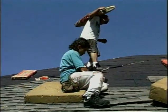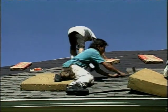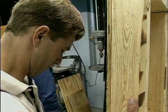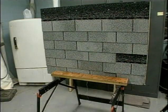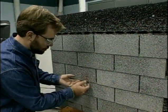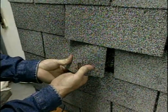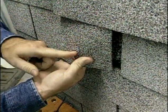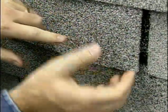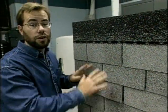The most common roofing material in the U.S. is the standard asphalt composition shingle. Composition shingles are available at different price levels and varying degrees of durability. We shot some ice at a mid-range composition product. As you can see on this composite shingle, it did make a perforation all the way through. In most states, if an insurance adjuster can find five of these in a 10-by-10 area on your roof, they'll call to replace all of the roof on that slope of the house.